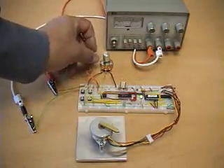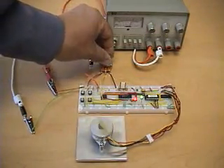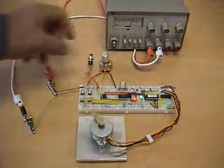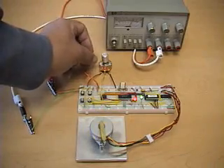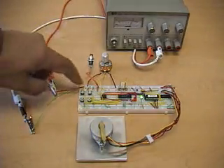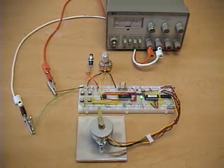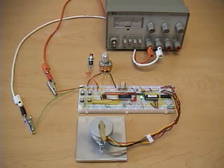If we go back into speed mode and move to a slower speed, then enter position mode again, the motor can now track the positions starting from zero speed. To move a stepper motor at a fast speed, you have to gradually accelerate to get to that speed — you can't start at that speed immediately.